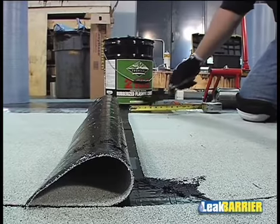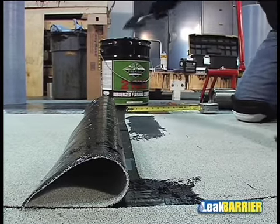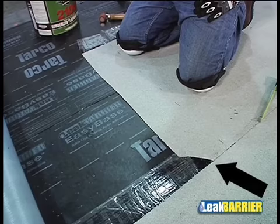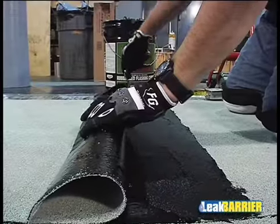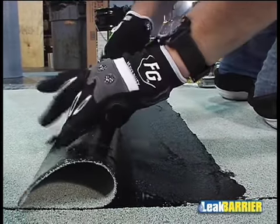Apply an SPS trade-grade modified flashing cement adhesive that meets ASTM D4586 and D3409 along the area where the 45-degree angle cut was performed. When addressing granule-over-granule end laps or any other granule-over-granule contact, it is acceptable to use SPS trade-grade modified flashing cement adhesive in those areas or a hot air welder to achieve the necessary adhesion.